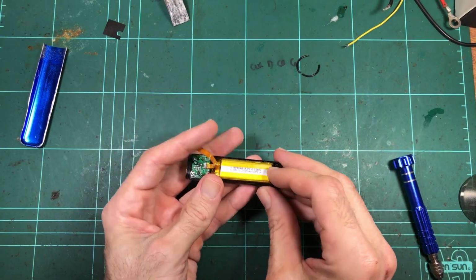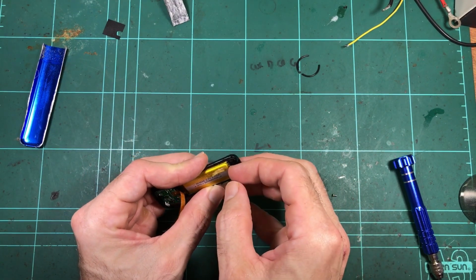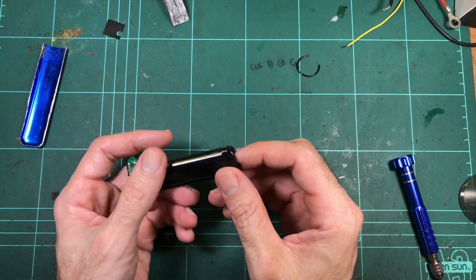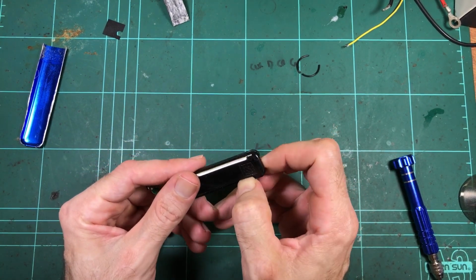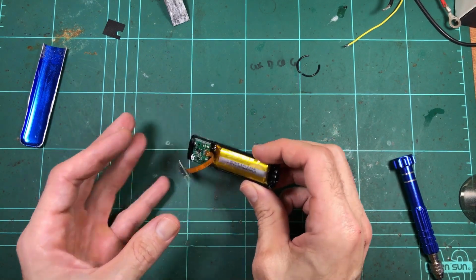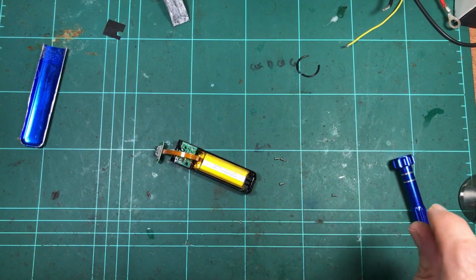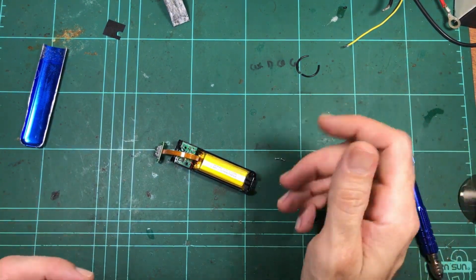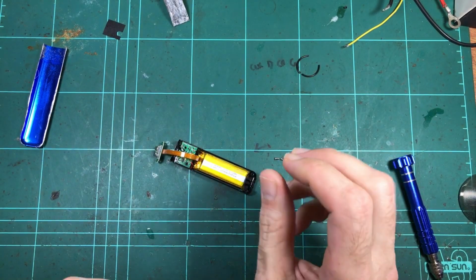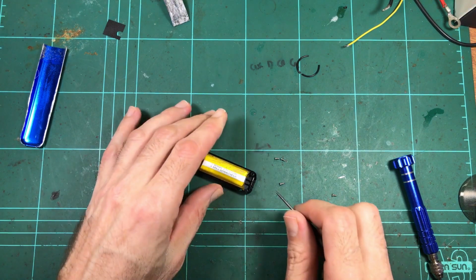We'll see. We'll put it on the CBA, and we'll do a discharge on it. We'll see what capacity. Now, the one thing I did think is I'm probably lowering the capacity just a little bit by obviously using it first, but it shouldn't be that significant, unless it's charging too fast or doing something wrong. So I'd have to account for just a little bit of capacity loss, because I've used it for the life of 2 coils. So not a huge amount, but not nothing either.